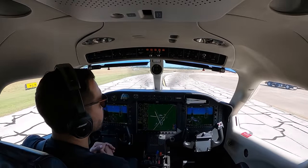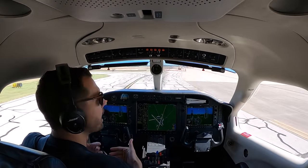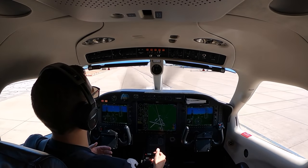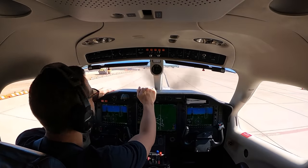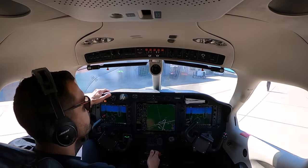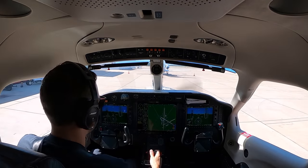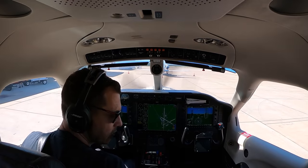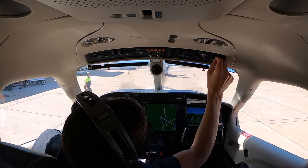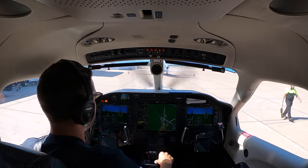When I was doing the PT-6 turboprop world, I had a misconception about beta. I thought when you throw it in beta at low speeds it's potential for ingesting FOD. You don't want to use reverse thrust at too low a speed, but you don't get reverse thrust until you go back further and you actually feel the spring tension. Beta all it does is it goes to zero pitch — you could use that to a stop. These things will taxi at 30-40 knots if you let them. Going through the shutdown flow: AC off — that's better for about fifteen seconds.